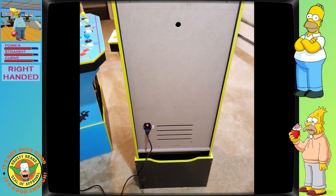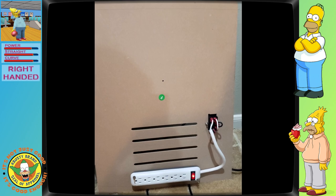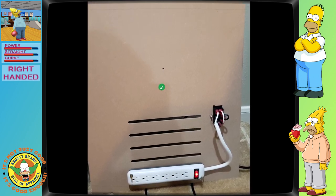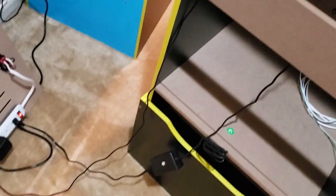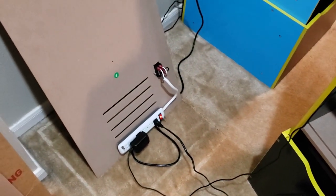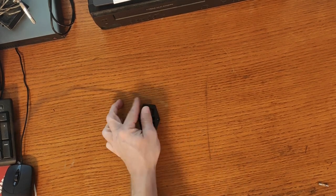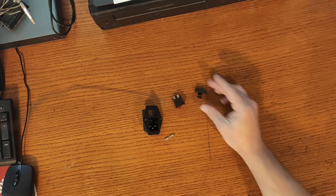To meet my needs, I'll be using a combination of two pieces of hardware. One is an inlet switch, and the other is a common power strip that I've hardwired to the inlet switch and mounted to the inside of the back panel. This gives us a very clean look on the outside, an interior and exterior power toggle, and multiple power ports for our external USB hub and our PCB board. The inlet switch comes in four parts: the main housing, a fuse, a fuse mount, and a switch.